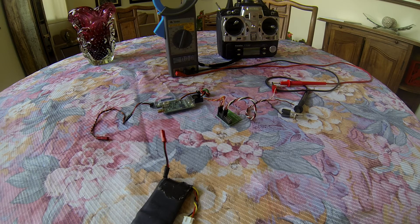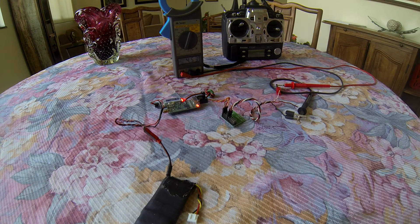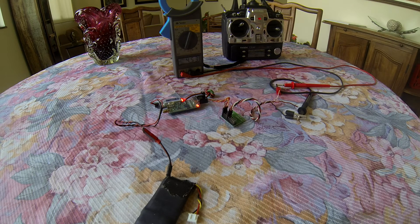Power on the receiver and I'm getting 4.5 volts. Now with the transmitter on, it's receiving and you get typically 1.7 volts with the radio in near proximity to the receiver. This is link quality on channel number 6.